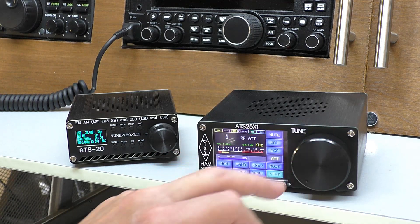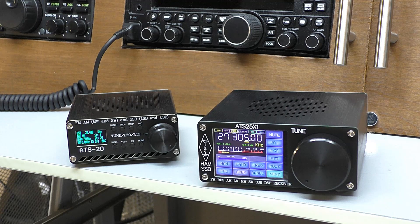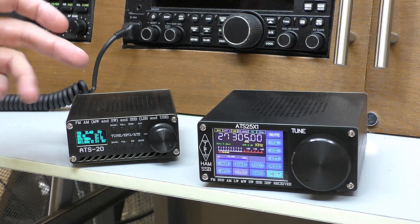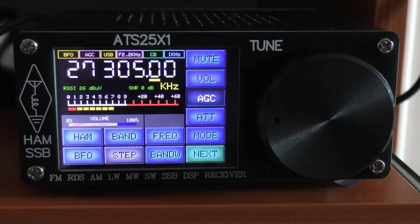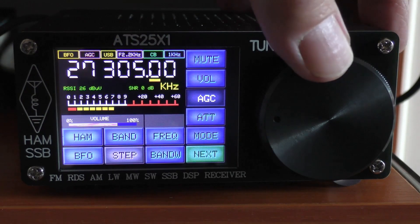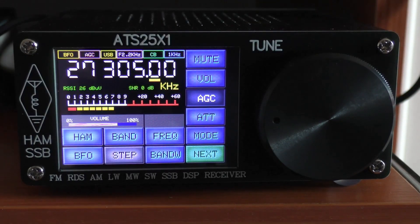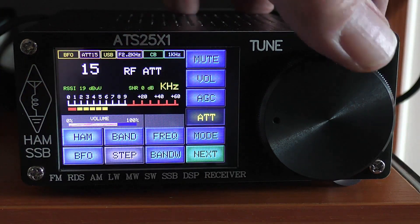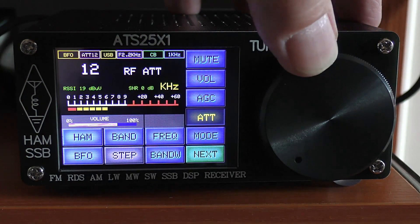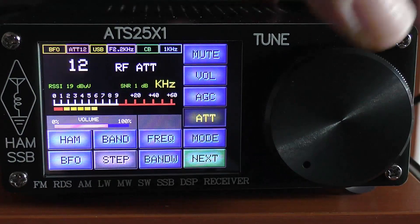Anyway, I'm going to wait for some of the guys to come on to the 305. They're all at different distances from my station and we're just going to give it a test. I'm hoping it does better than the ATS20 — I'm not sure it's perfect yet, but let's give it a test and then discuss the results. First thing I want to do is turn down the tuning step — I'll do this by clicking on the display, it's quicker than going into the BFO — and then I can use this very much like an on-the-fly clarifier. I'm going to set the attenuator, switch off the auto gain control, and set it around about 12 to 15 to start with, and I'll turn it up or down accordingly.